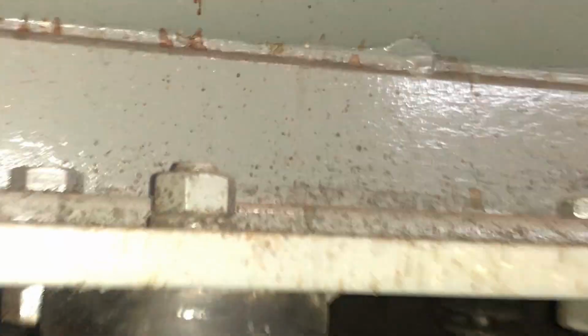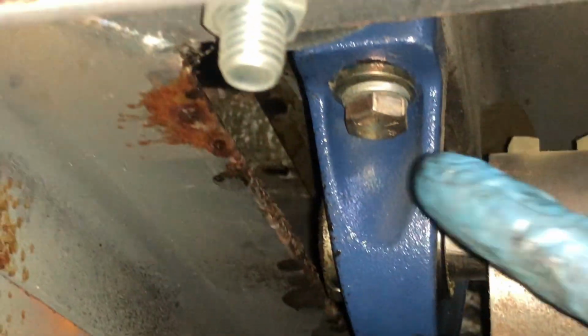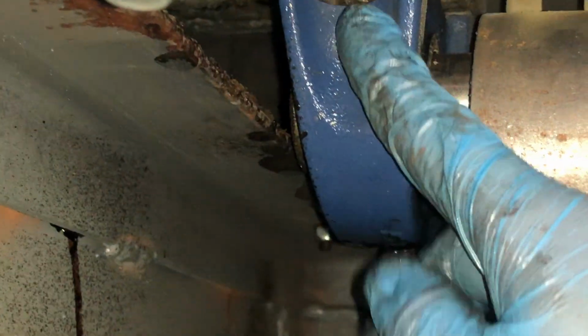So what we did is we removed two bolts. This one, the one in the back holding the bracket. We removed the grease fitting that goes right here, it was this one, connects to the side and it goes in there. On this side, I just loosened it just so it gave enough slack for this side so I could wedge the belt out from that. So it's really difficult to take this completely out. I've done it before, so I don't want to do that. So I loosened both this front one and the back bolt.